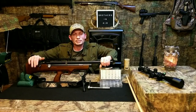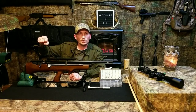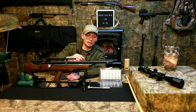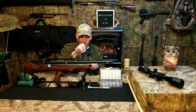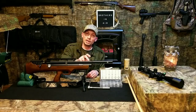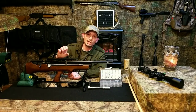When doing this, it's not too tight — just snug it down. You can feel the pressure and you just give it a good snug. You don't want to reef it down. That nut is aluminum, the barrel is steel — you don't want to take the chance of drawing it in too far and stretching the aluminum as the nut tries to pull into the taper. You don't want to strip the threads either, because that's soft aluminum and the barrel threads are steel. Just snug it down — it doesn't need to be tight.